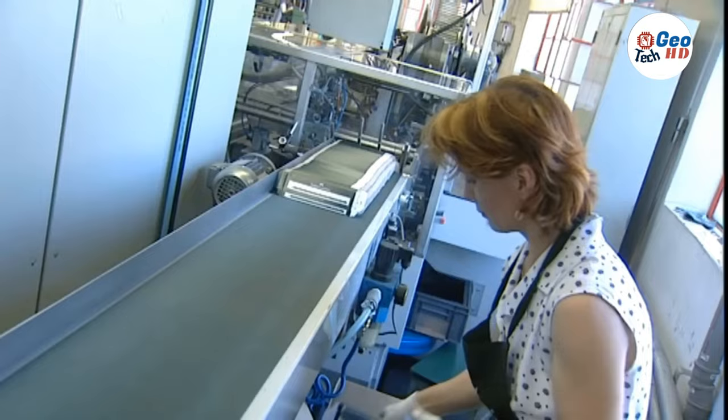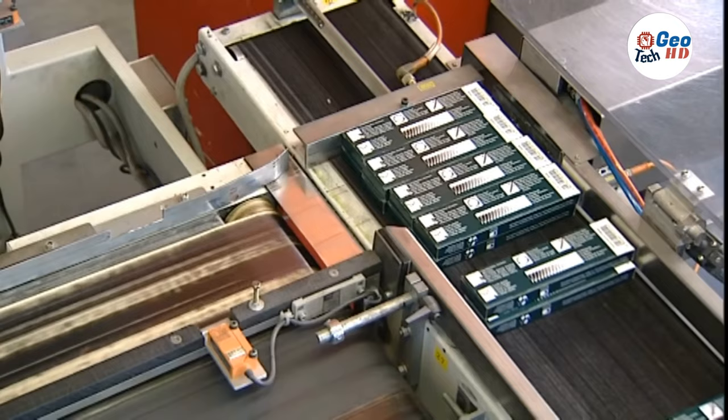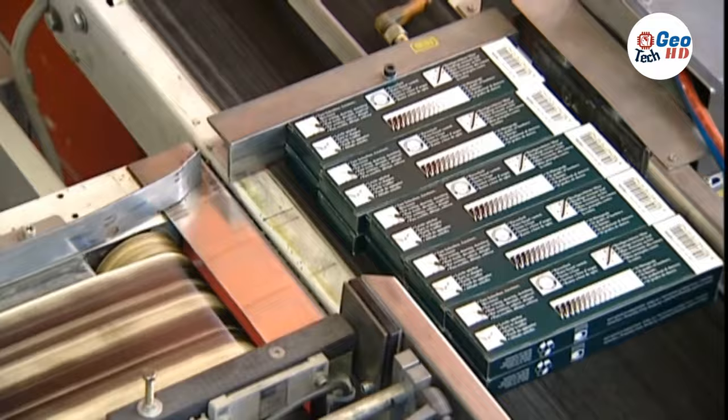The majority of pencils are hexagonal, so designed to keep the pencils from rolling off surfaces; a single sandwich yields six to nine hexagonal pencils. After the pencils have been cut, their surfaces are smoothed by sanders, and varnish is applied and dried. This is done with varnishing machines, in which the pencils are immersed in a vat of varnish and then passed through a felt disc, which removes the excess varnish.